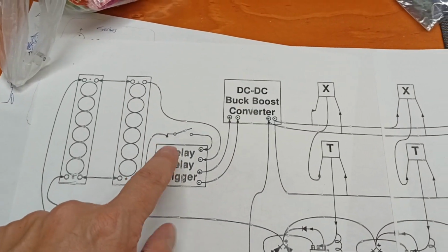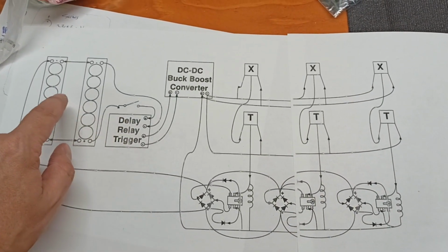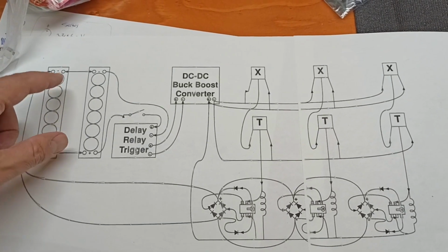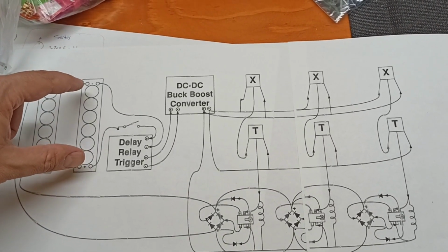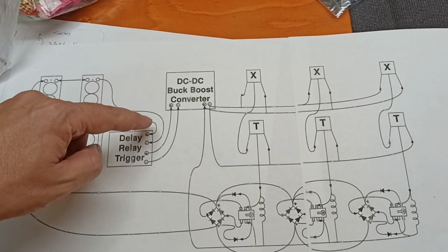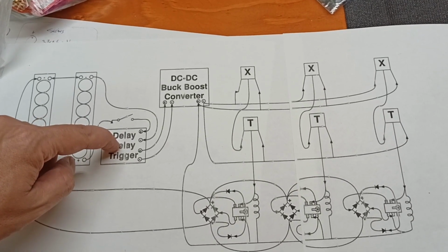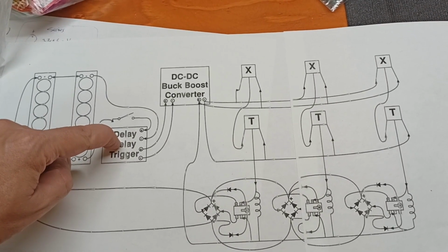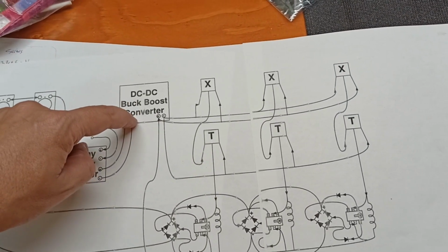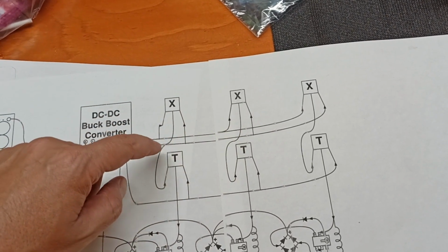One of the things in there is this guy. So my intention with this is to be able to take the back EMF and pump it into here, and then parallelize it across another 24 volt capacitor bank. This acts as our source, then sending it into this trigger time delay. So we're going to run the whole system for about 5 seconds, and then turn off for maybe 8 to 10 seconds. But when it's on, it'll go into the DC buck boost converter, and then that'll go to the Hall effect sensors after it goes through.